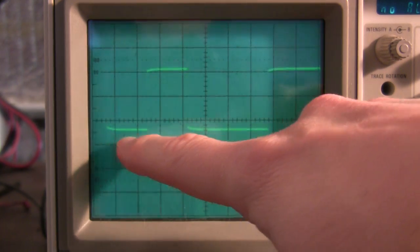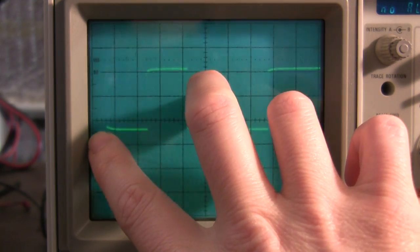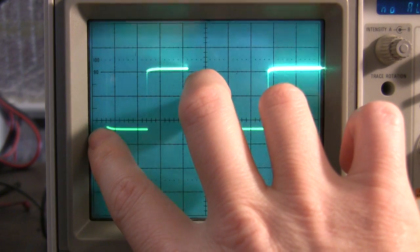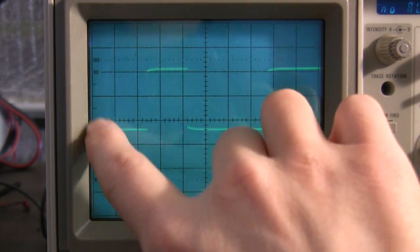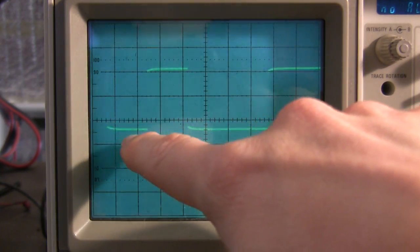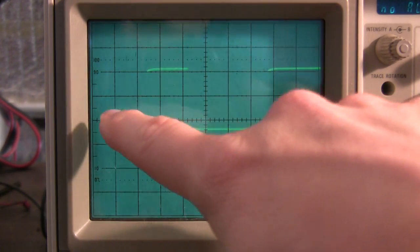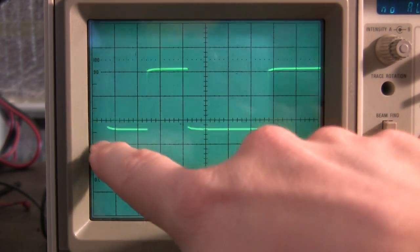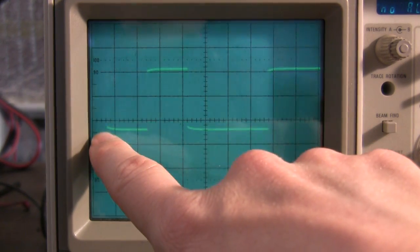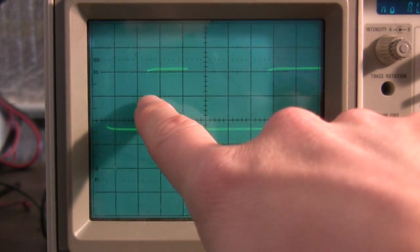Now, Manchester encoding is actually taking up this whole pulse here, from high to low. These transitions are the only things that matter, and in Manchester encoding, the data is represented by a change in the middle of a pulse. So the first edge we get is the first bit of data. That's a 1.